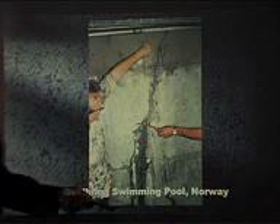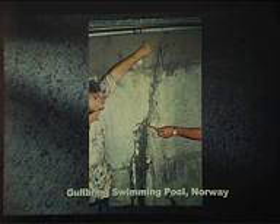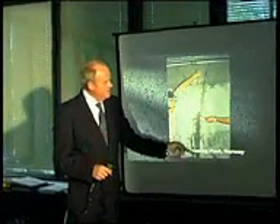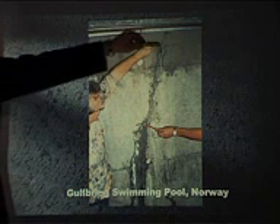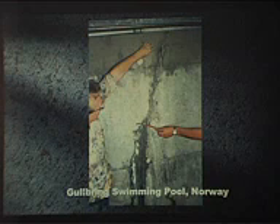This is another interesting swimming pool story. This is a Gilbring swimming pool — a diving pool that is 15 feet deep at the deep end. Our applicators had completed the Radcon job and the pool was filled up, but there was still leakage evident. What this slide is showing us over a period of days is that at the deep end, where there is heavy hydrostatic pressure, leakage took some days to seal. Up at the shallow end, after the second day, we're seeing it start to dry up. This is proving again the ability of Radcon: once it is into the cracks of the concrete, even if there's not an immediate seal, under hydrostatic pressure the product will still grow across and seal from the inner edge right the way through the concrete slab as it grows its gel reaction.